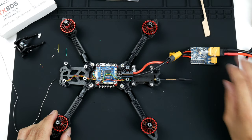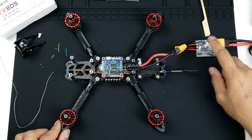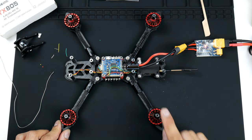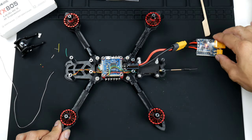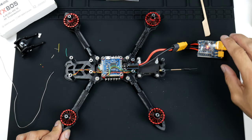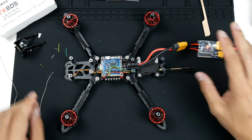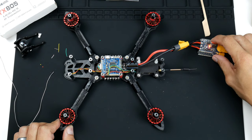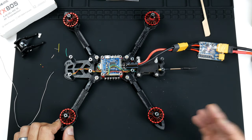It goes into standby mode and I'm going to power it up — but it's going to be a bit different this time. You can see it automatically just shut off. So does that mean we have a short? Not always. This smart smoke stopper by ViFly has a one-amp limit, so if anything in the circuitry is drawing more than one amp it will automatically cut off. It does have another button to change it to two amps.